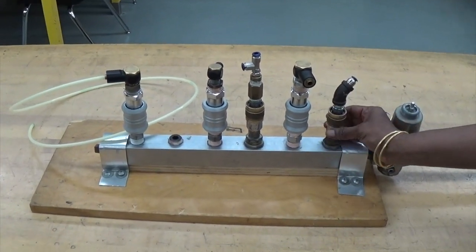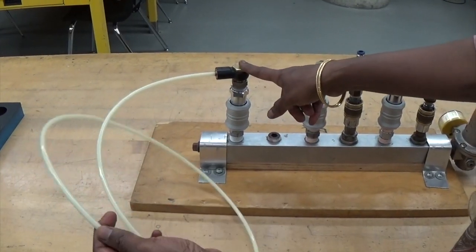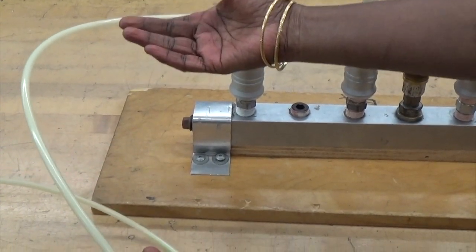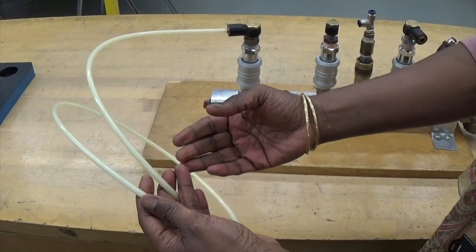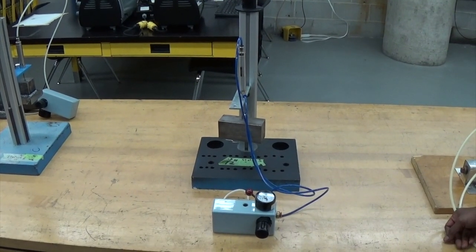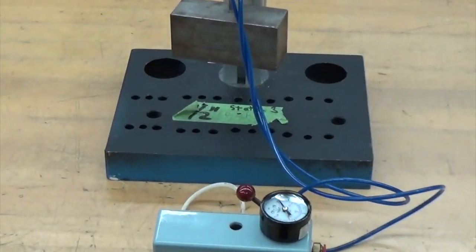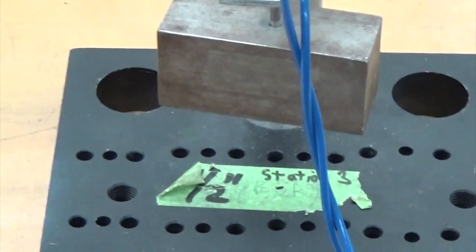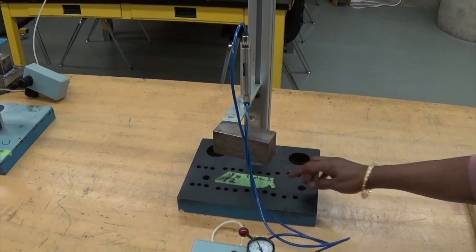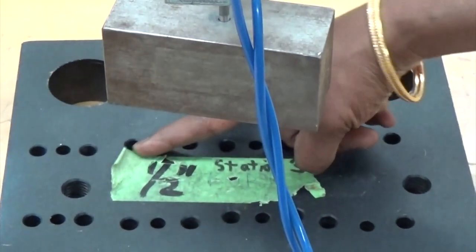I have to turn it on by taking it up. Now I am going to use this outlet for today's experiment. I have connected a 5 by 32 tubing here. This would go into the device. This is the apparatus for today for verifying Pascal's Law. I am using station number 3. I shall show you station number 3 where you have the bore diameter marked.